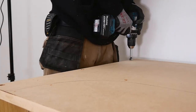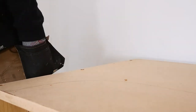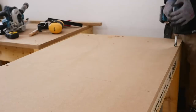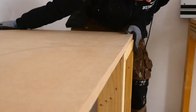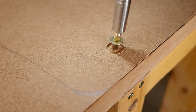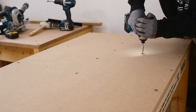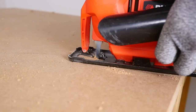Plus it leaves the workbench looking pretty and clean, while still being very securely screwed down to the frame. The way that I put tabletops on a frame is I start on one corner, going down one edge and then 90 degrees on the other edge. Then I go to the opposite corner and pull it tight to pull the entire structure true, meaning that you will remove any wobble that might be in the frame. Once the tabletop is secure, it's time to cut along that curved line. I just went at it with a jigsaw and some sandpaper and it came out pretty nice.